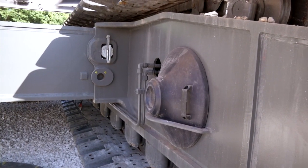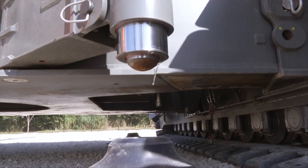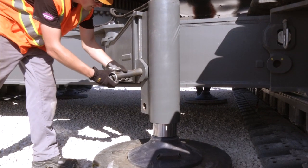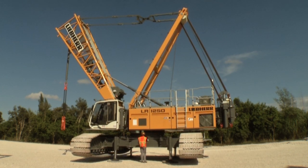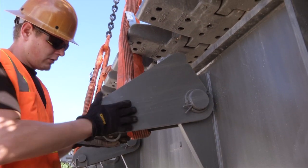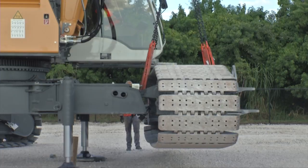The outrigger pads for the jack-up cylinders are placed in the useful storage trays on the undercarriage during operation. In order to activate the cylinders, you first have to pre-select the cylinder function on the right-hand X23 control panel. Then control is shifted to the manual valves on the undercarriage. Bring the cylinder into the lower pinning position in order to allow for maximum supporting height, and then extend the cylinder until contact is made with the ground. The alignment of the upper carriage can be checked using the level gauge located on the undercarriage by the control levers. During this process, ensure that the cylinders are equally extended. Then attach the slings on the designated lifting points. The foldable design prevents the crawlers from damaging the assembly rigging. Remove the pins from the crawler side frames and pull the crawler off the car body wings.